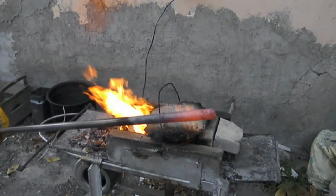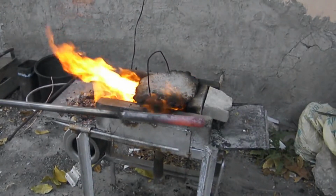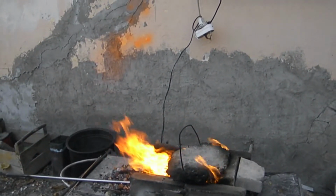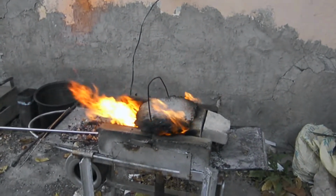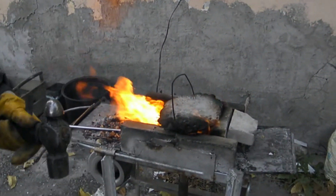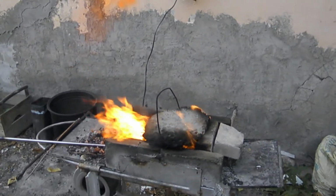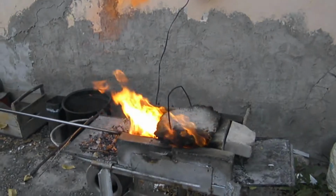So the Silversteel stick is at 400 now, it's dropping. It was 600 before. And which temperature do we try to reach, Gökhan? Around 850, or maybe 900. If it goes above this, there is something called grain growth, but I don't know the English. The particles will be too big, and then it's not so good. It breaks earlier, it's brittle.